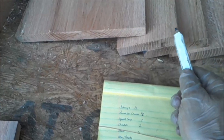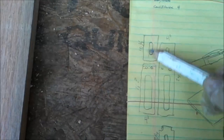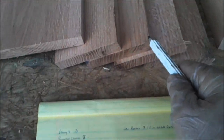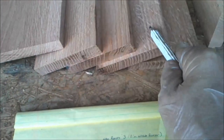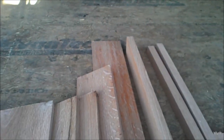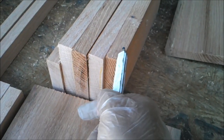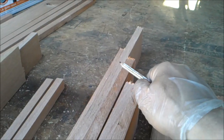We've got our press plate, and we've got our ten-and-three-quarter-inch piece, which will be the cross member across the top of it. We've got our eleven-and-three-quarter here, which will be the piece that rides in the middle on top. Then we've got our 16-inch side and our 24-inch side — and the same over here: 24, 16, eleven-and-three-quarters, and ten-and-three-quarters. Now the ten-and-three-quarters will sit into a dado that will be in the 16 and the 24 up top.